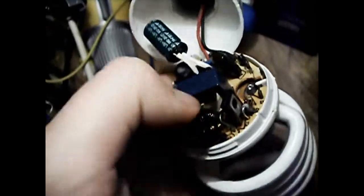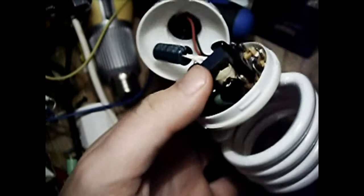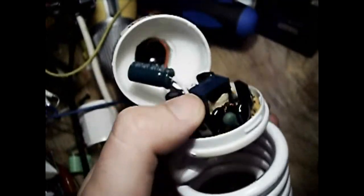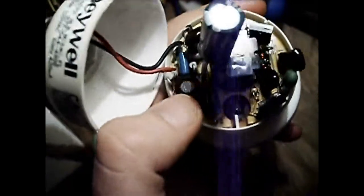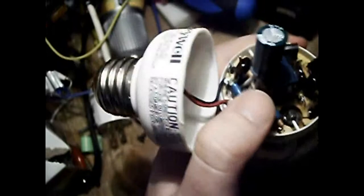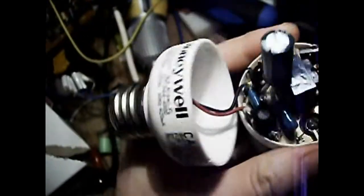There's a little main transformer and a little core down there, which is the feedback transformer for the transistor bases, which are of course not heat-sinked — kind of dubious. But then again, there's your standard Royer oscillator topology — really crappy. It does actually have a QRM-limiting choke there, which probably also serves minimal current-limiting function, but proper QRM filtering covers both leads. And of course there's your typical fusible resistor instead of a fuse — so another thing to cook off.